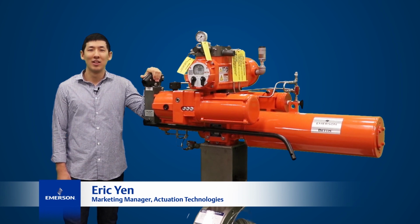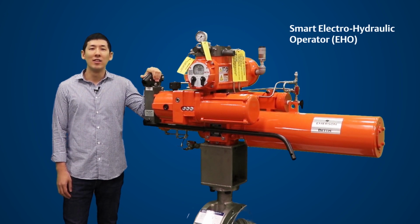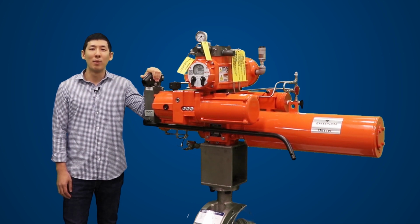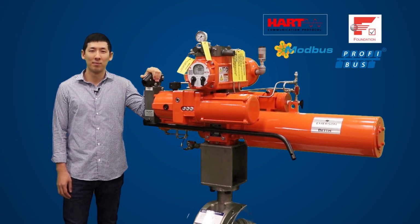I'm Eric Yen, the Product Marketing Manager for Electro-Hydraulic Operator, also called the EHO actuator. This is a smart EHO designed for fail-safe applications. The smart version has diagnostics, alerts and alarms, positioning and modulating capabilities, and can connect to common communication protocols.